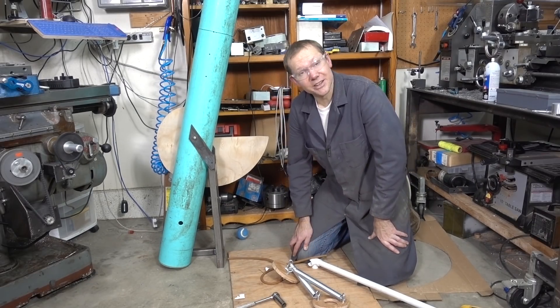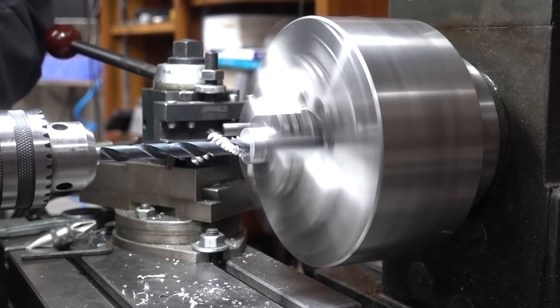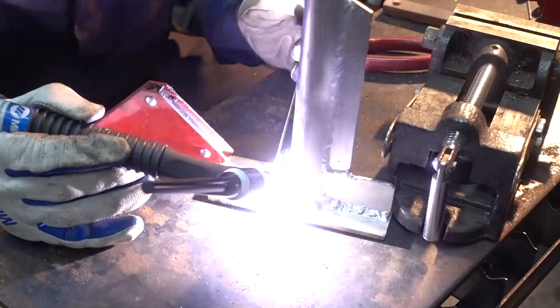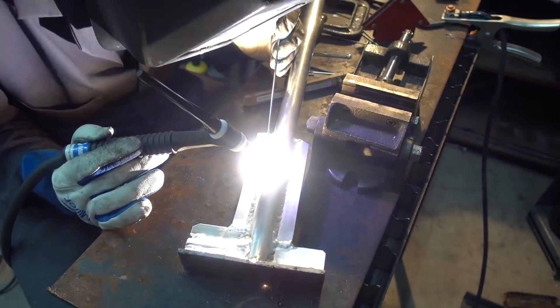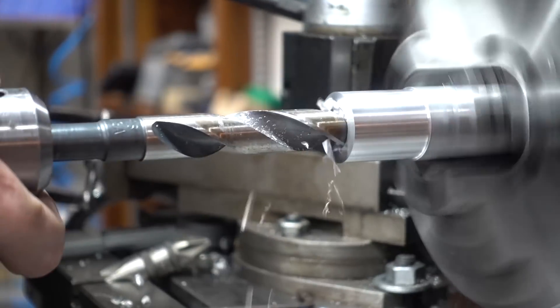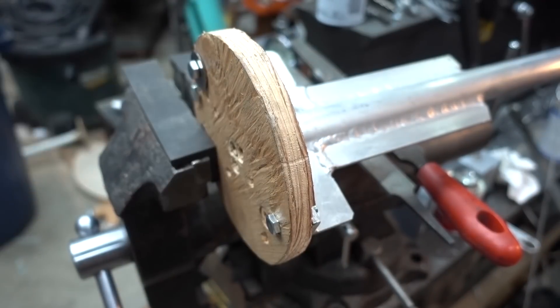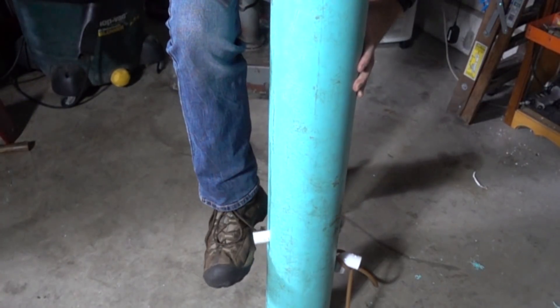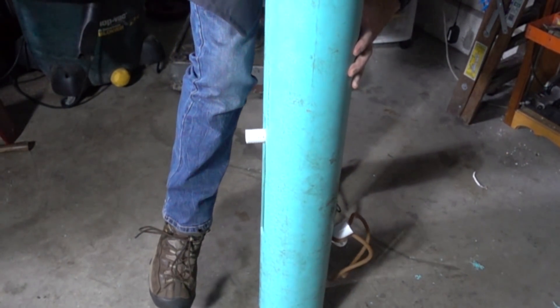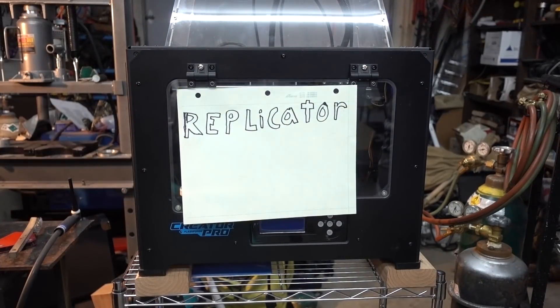I said at the beginning I was going to try to build this with basic hand tools, but I'm running out of time and patience, so I'm starting over with aircraft-grade aluminum. It's super light, really strong, and is the material I would have chosen from the start. It also allows us to add machine features and threaded fasteners, enabling the use of a bearing inside the follower on the cam, minimizing friction. I'm not getting rid of all the wooden parts — it still makes sense to have a wooden base to ride on the inside of the pipe without cutting it to shreds. And since my previous attempts to cushion the plunger with surgical tubing were unsuccessful, I'm building a set of secondary springs to catch and decelerate the plunger rather than letting it slam to a stop. They're difficult to build, but after making the first one, I was able to use our replicator to quickly get an exact copy.